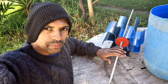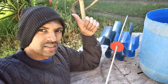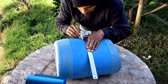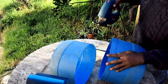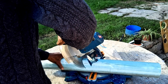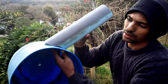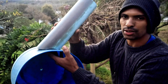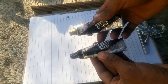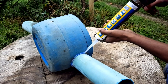With our turbine finally complete, I'm going to use this container to help funnel water in, around and out of the turbine. I marked out a few lines about the same height as the turbine, connected the dots, and cut. Then drilled a center hole for the turbine to go through. After that I cut a few pipes at an angle and sanded them. I drew two holes in the side of the bucket, mixed together some epoxy to anchor the pipes to the container, and later filled the gaps with some silicone.